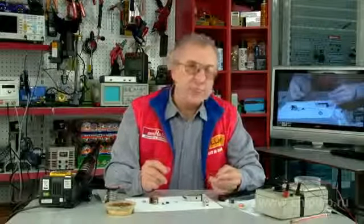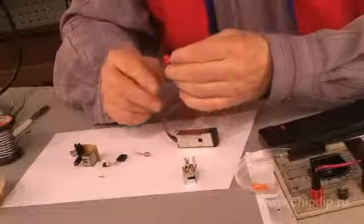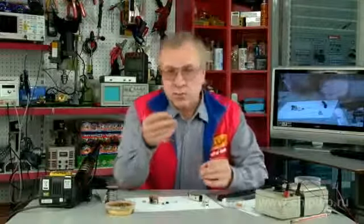Let's use a common remote control for testing. The second option, using a key bipolar transistor, includes a photodetector, one more resistor of 600 ohms, a bipolar transistor with a PN junction, an LED, and an optional additional acoustic indicator, a piezoelectric transducer.